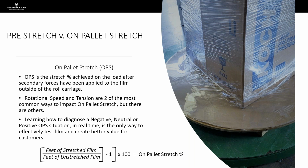So on-pallet stretch is the percent of stretch actually achieved on the load when we've had secondary forces applied to the film. Sometimes pre-stretch is referred to as F1, so that's what's going on inside the carriage. On-pallet stretch or post-stretch is sometimes referred to as F2. So knowing the relationship between those two is really important for us. You can achieve a difference in your on-pallet stretch by manipulating that rotational speed and by using that tension or force knob on the equipment.